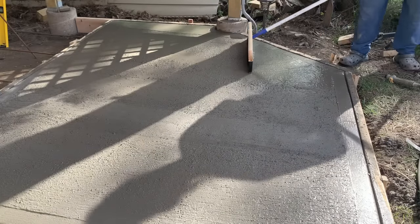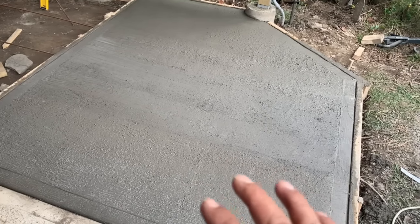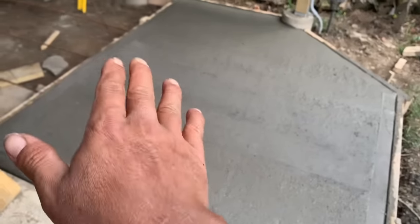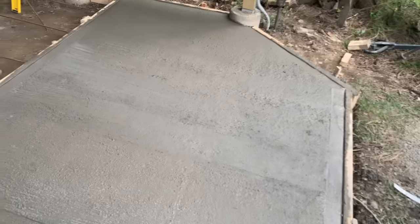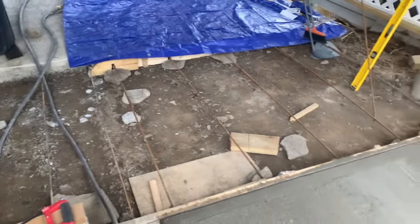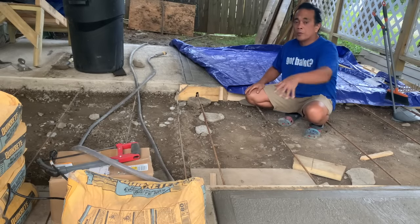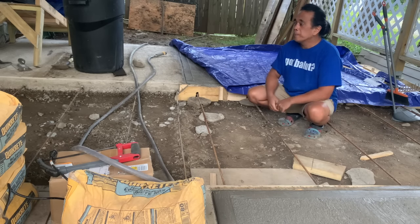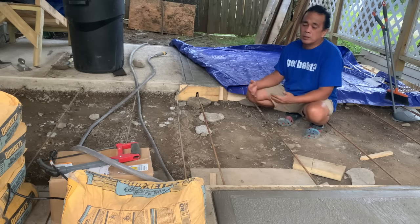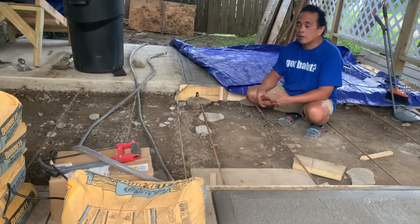Brooming and then edging it once again — it's been close to three hours and it's still a little moist but getting there. This half is going to dry much quicker than the other since that one was just freshly poured. As this is drying, I'm going to start prepping the middle part. This part will be a lot easier because the two slabs in back and the two in front are already leveled with each other with a slight slope toward the driveway, so I don't need to put up two-by-sixes anymore.